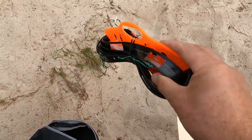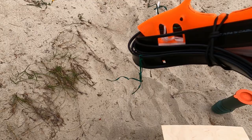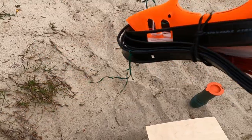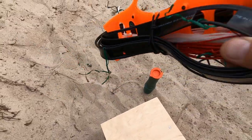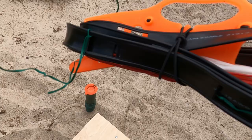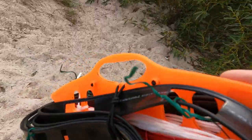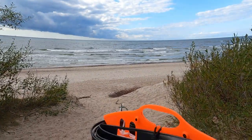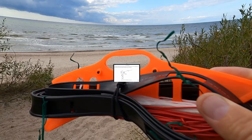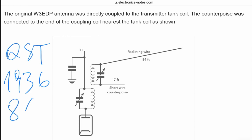This is one of the most unusual antennas I've ever seen. It's supposed to work on 80 to 10 meters and its name is W3EDP Junior. It's like a 10-meter long piece of wire fed by a 2.5-meter long window line, and it's supposed to be a multiband HF antenna. I'm very excited to test this antenna in the field on this beautiful Baltic Sea coast. The original W3EDP antenna was first described in QST magazine back in 1936, so it's 86 years old.